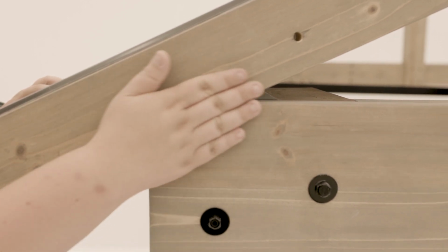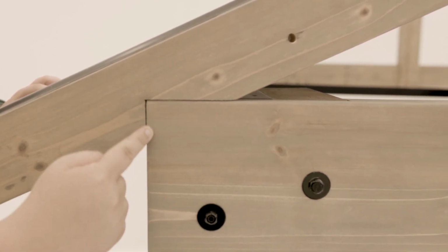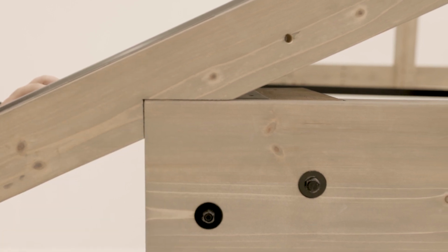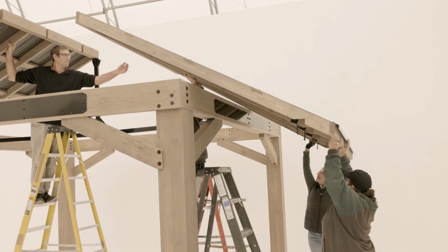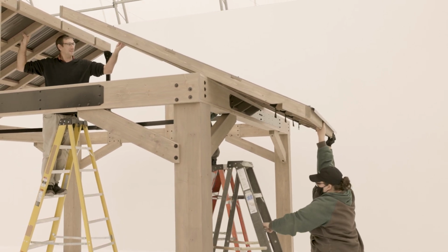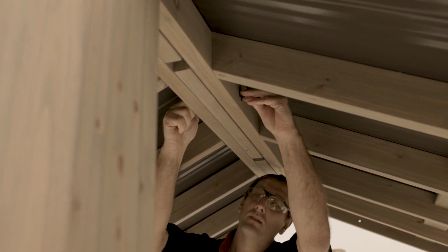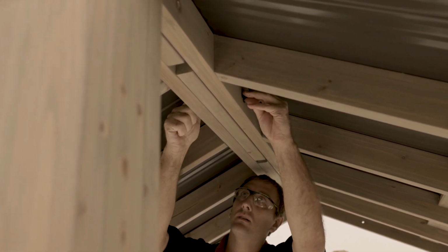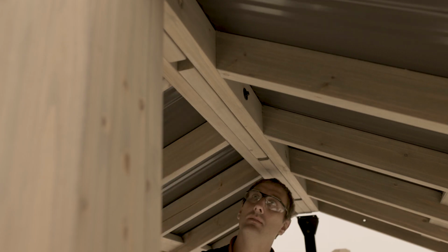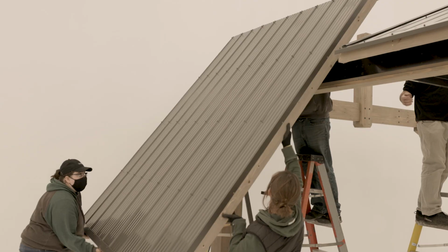Check to make sure that the corner of the roof panel is sitting flush to the beam and that notches in the rafter are tight to the side beam. Bring a left panel assembly without roof ridges in and onto the frame in the same manner. Then loosely attach the panels together with hardware. Note that the center rafters in both panels are towards the middle of the unit.